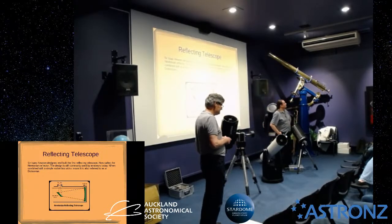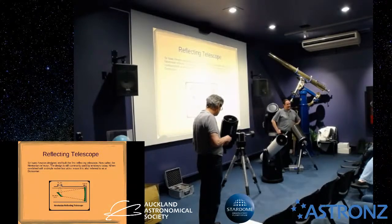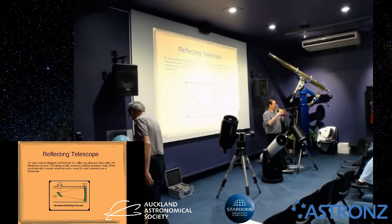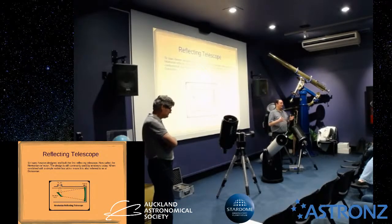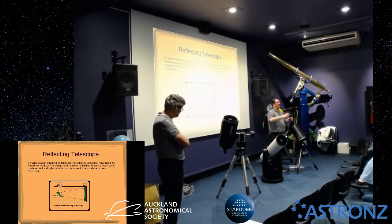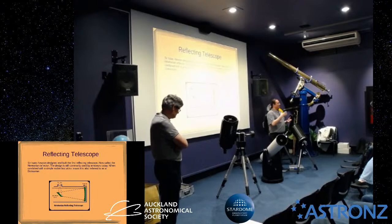Oh, do they? Okay. What happens if you've got an older telescope without a dot? So, that does happen, and what I do is put a dot on the mirror. Now, it is true that the geometric centre of the mirror, you can work out where that is, isn't necessarily the optical centre, because it's possible to have a circle and then cut out a circle that was, you know, a quarter of a centimetre to the left, and then the centre of that mirror isn't the centre of it. But generally, because of mass production, they're pretty good.